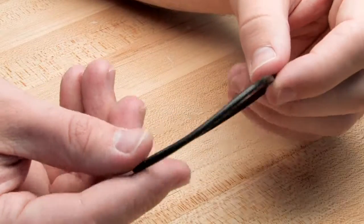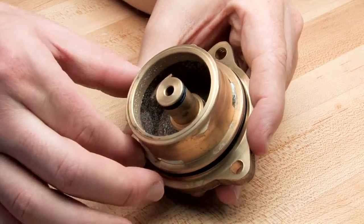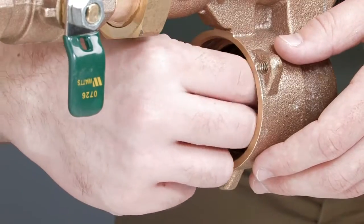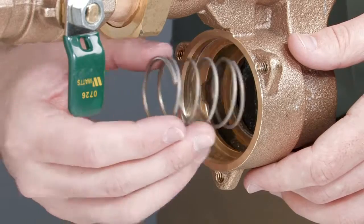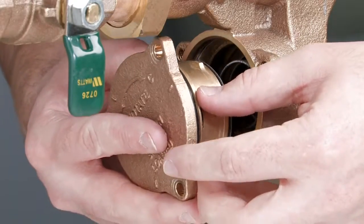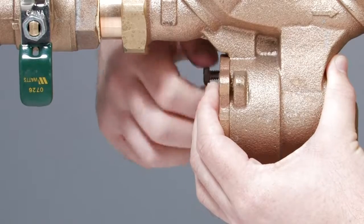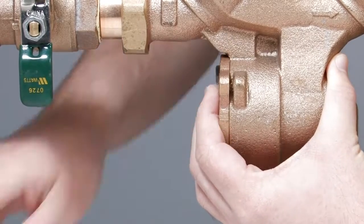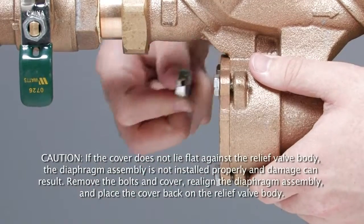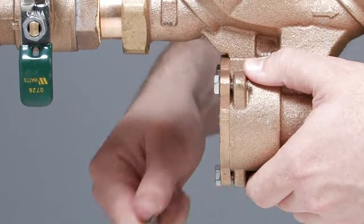Finish by inspecting the cover and the cover O-rings. After your inspection, lubricate each of the cover O-rings and the seat O-ring before reinstallation. Begin reassembling the relief valve as shown with the seat entering first, then the spring, diaphragm assembly, and the cover. To replace the cover, first line up the cover grooves with the grooves within the relief valve body and turn a quarter turn clockwise. Ensure that the cover is properly seated. While applying firm pressure to the relief valve cover, replace the bolts and tighten evenly until the cover lies flat against the relief valve body. If the cover does not lie flat against the relief valve body, the diaphragm assembly is not installed properly and damage can result. Remove the bolts and cover, realign the diaphragm assembly, and place the cover back on the relief valve body.